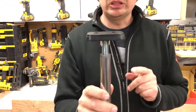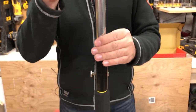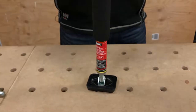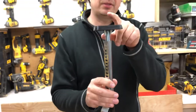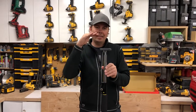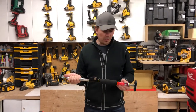When you turn this it gets taller and taller. These are really good if you're doing upper cabinets and you need to fine-tune — get them in place. Or if you've got a tack strip on the wall, the cabinet is sitting on that strip and this is across the front, you can adjust and fine-tune that height. Pretty cool little product to have.